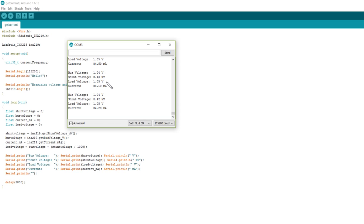We're not getting the bus voltage — it's showing as only 1.04 volts and the load voltage is also about a volt. I think we won't get the proper bus voltage unless we ground the minus side of the high-current circuit to Arduino ground. I'll do that next.